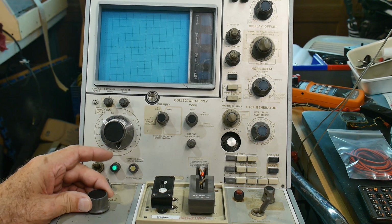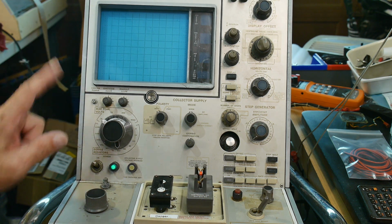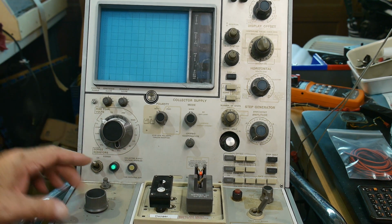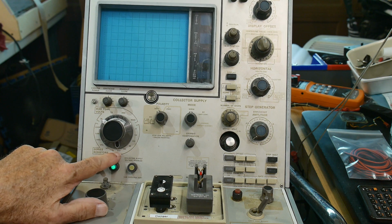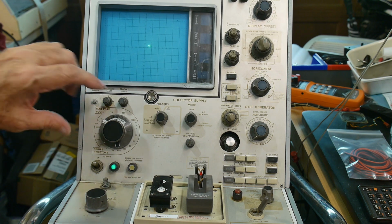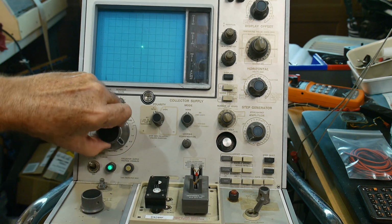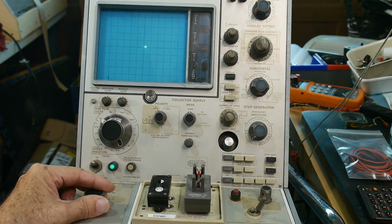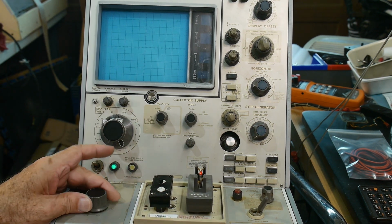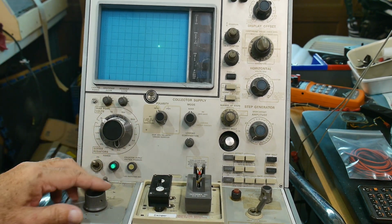And I can go up here to 80% of 15 volts. But I have a series resistor. That series resistor is down here, okay? It's a series resistor. So I have it as a 650 ohm resistor. Now, to change the resistor without changing the voltage, you pull this knob, and now you can change the resistor. So I can change it to, say, 140 ohms. And now as we go up, it doesn't take as much voltage to start turning on the LED, okay? It'll get much, much brighter. All right, so I'll put it back down here to 650.